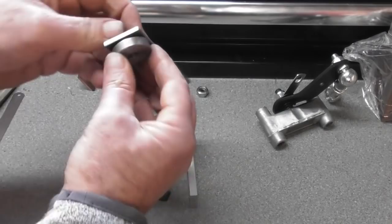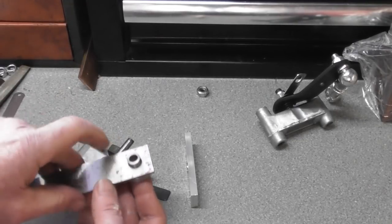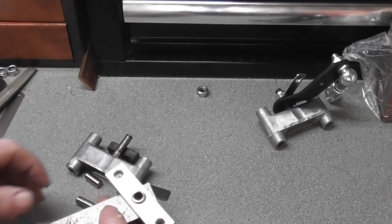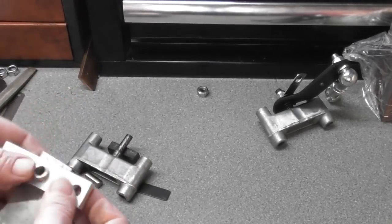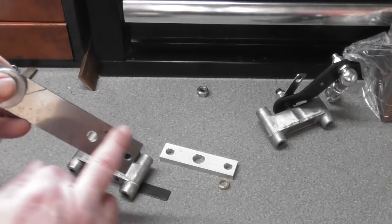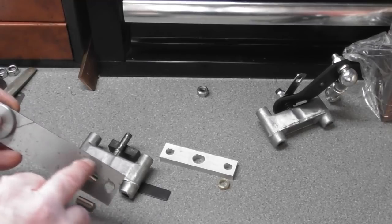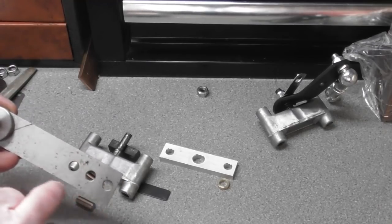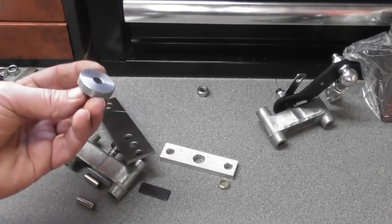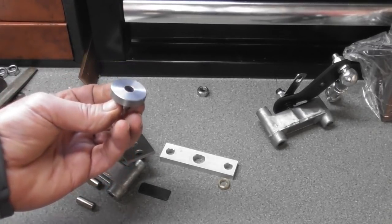So to summarise what we've made so far: the disc, the arm, a little bridge that goes on top, and a little brass spacer. This will be shaped at a later date to follow the shape — we may taper it down with a radius on the end to tidy it up. I'm going to put a series of holes in one side to take the end of a tension spring at various points, giving means of adjusting the spring position. The interesting bit now is machining the little ramps, and I've left the boss on the back deliberately as part of the design to give me something to hold onto.